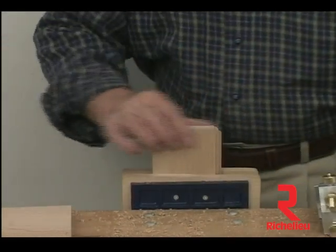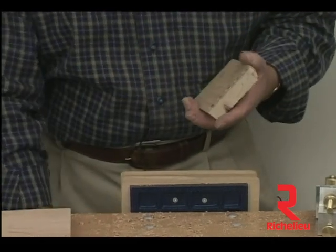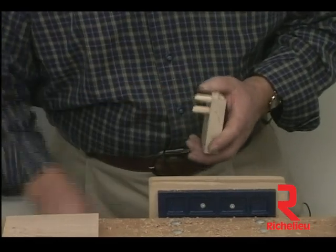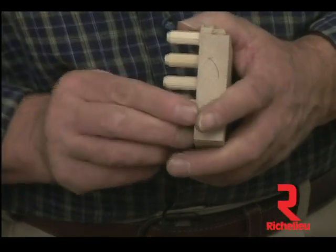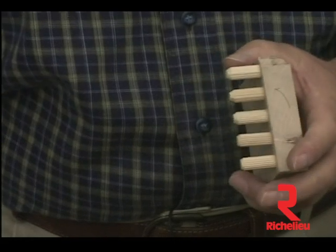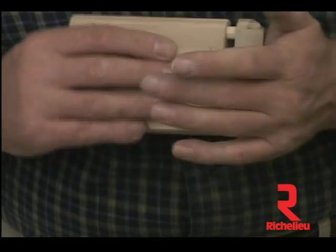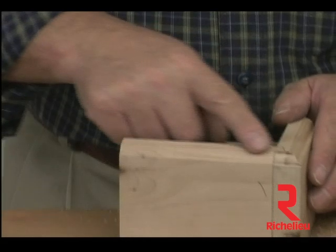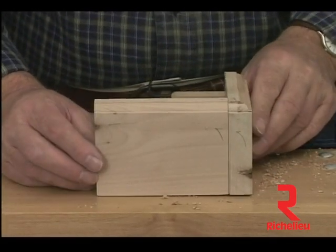Remove Dowelmax. Clear the bores. Install the five hardwood dowels. Take the second workpiece. Now we have a perfect joint with the top edge perfect and these two faces perfect, and a very strong final joint.